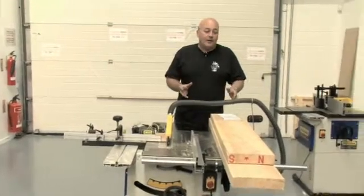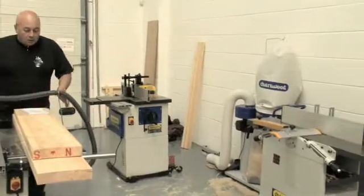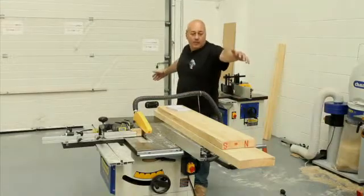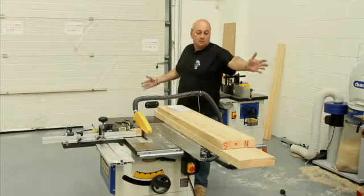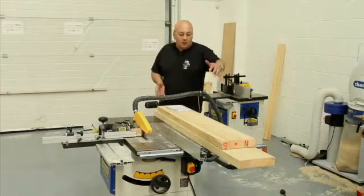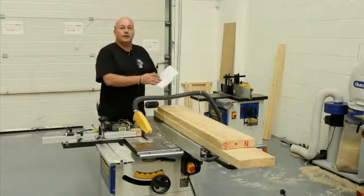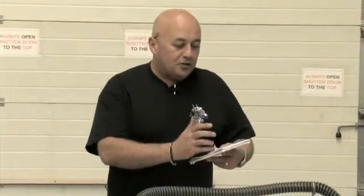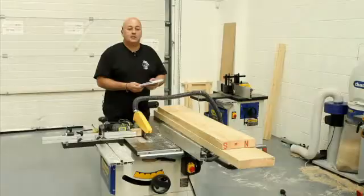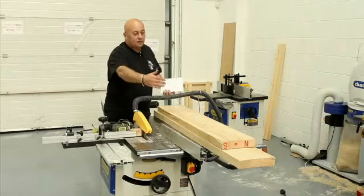The principle behind that, as you can see here, is for dimensioning timber to set lengths, because what you don't want to be doing is working massive 12-foot planks, or whatever, rather than getting it down to component sizes. So what you're looking to do first and foremost, as I've done here, is do a sketch of what you're looking to do in principle with the dimensions on it of your finished sizes, and from there you make yourself a cutting list, which would then give you dimensions to work to for your initial stock sizing.